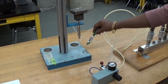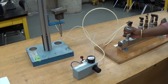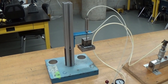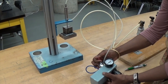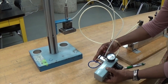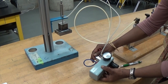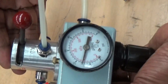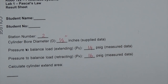Now I am going to invert the apparatus. The head end is going to be holding the weight again and it is going to be suspended. Air supply should be turned off before inverting the apparatus. Now the apparatus is inverted and the weight is suspended. Turn on the air. Now I am going to adjust the air pressure. You need more pressure for this, so I am increasing the air pressure and adjusting through this control. I have balanced at this point. The air pressure from the regulator is showing 16 PSIG. I have noted it - again the calculations using the formula should be shown.